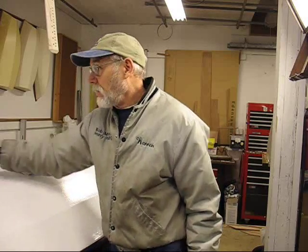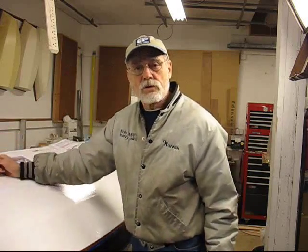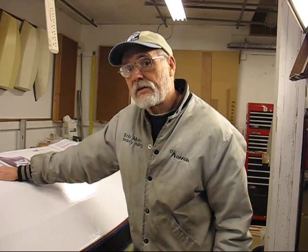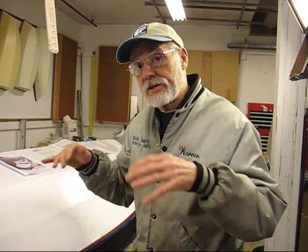I've got the bottom strip back on again. I overbored and instead of using Gel Magic in the holes I used easy fillet, but I think if I were to do it again I would mix up some epoxy, get a syringe, and squeeze it in so the tip is at the bottom and there are no air bubbles. I had a hard time getting the easy fillet down into the hole without leaving a cavity underneath.